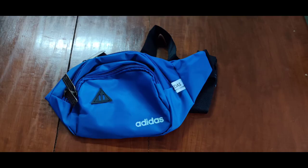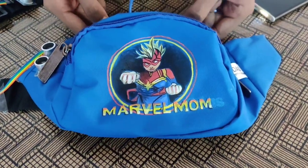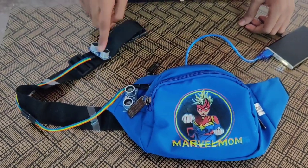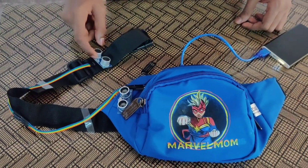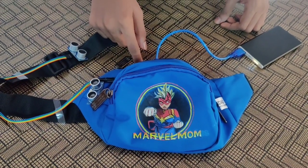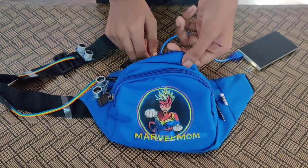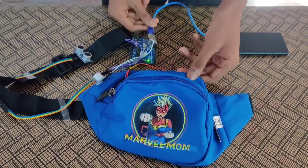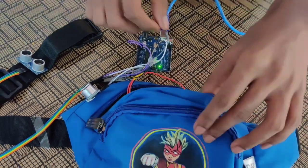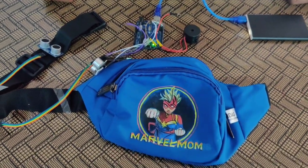This is how it is prepared. We took a fanny pack from the market and modified it to suit the need of our project, and more so to make it appealing to kids. The system uses two ultrasonic sensors to detect the maximum proximity of any person near you. The ultrasonic sensor sends ultrasonic echoes that are reflected by the object, a simple calculation is done, and the distance is determined. It contains an Arduino that acts as a microcontroller, which we have programmed. When the sensor detects an object six feet in front of it, a signal is sent by the Arduino and the buzzer gets triggered. This setup is embedded in the pouch bag that we have designed.